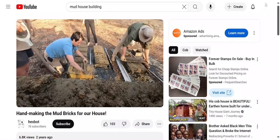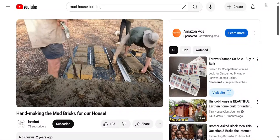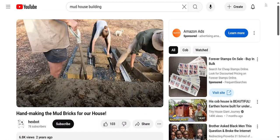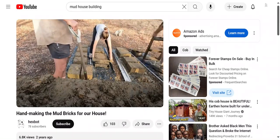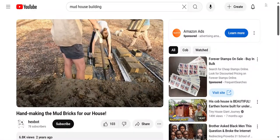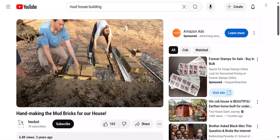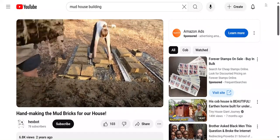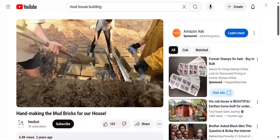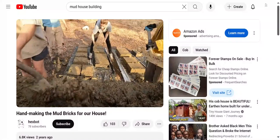Which is fine, except we went back to make more mud bricks the next day and the day after — that's just how it goes. The process is basically: throw the mud in, compress it down, flatten out the top, take the mould off. The little stick we use we call a modulator, so if you hear me refer to it as that, please don't feel too confused. I'm still making this brick — I have been talking for so long and I am still standing there making this brick at double speed. But hey, we got there in the end.